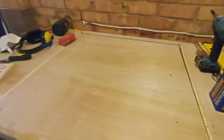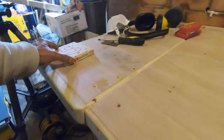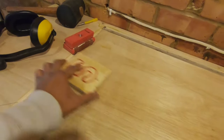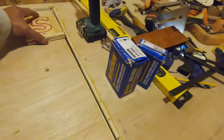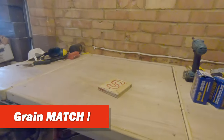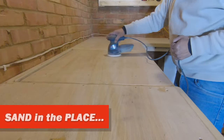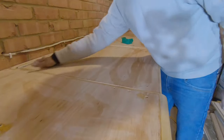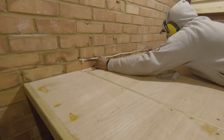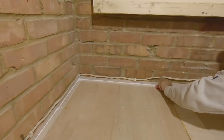At this stage it's important to check that the workbench is actually level with no dips or bumps. For me that's largely the case — there are a few minor dips, but because I put the 45-degree chamfers at the edges beforehand, everything just slides in. The miter saw is now tucked neatly under the bench. All that's left was sanding at 120 grit, cleaning up, and applying a decorative caulk at the edges so no dust or debris gets trapped between the wall and the bench.